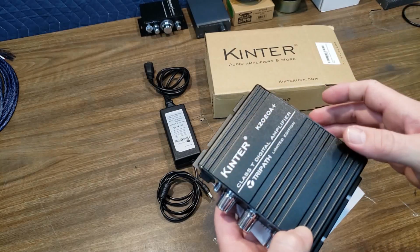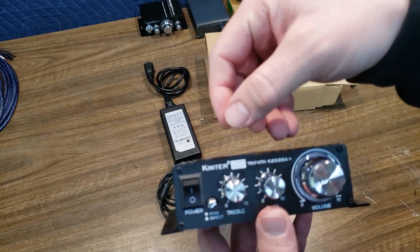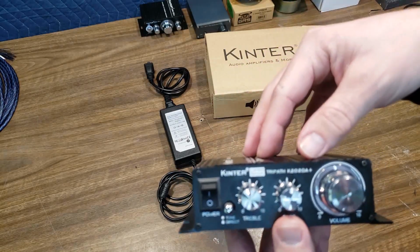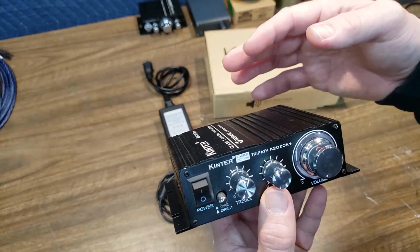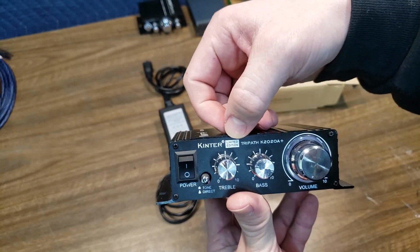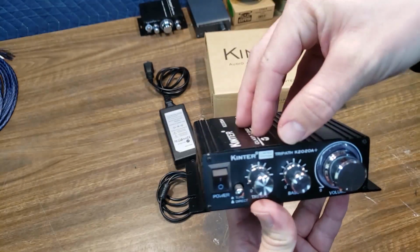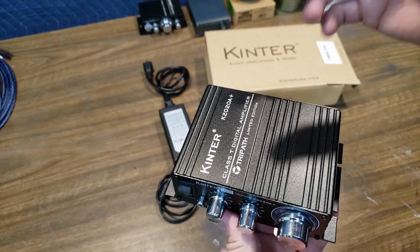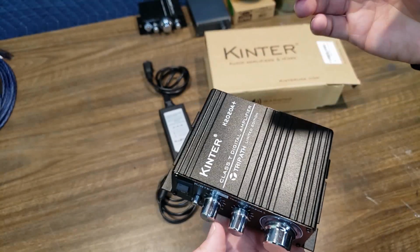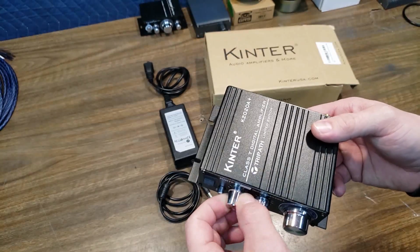Well, since we're already on this path, we'll just keep going down it for the moment. A lot of the chips that were left over were sold off to another company or other companies. There's still some around. They're no longer being produced, but there's still some around. So they put things like limited edition and Tripath to really kind of reel you in as a selling point. And back when these came out, they were typically better than most other Class D amplifiers, but as time went on, it's not really a big deal anymore. Other Class D technologies caught up and stuff.